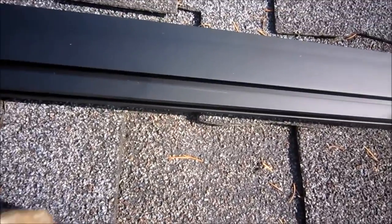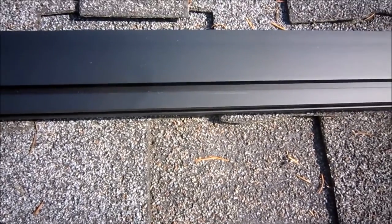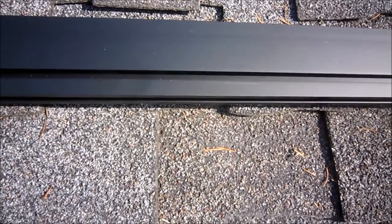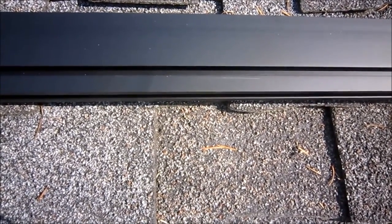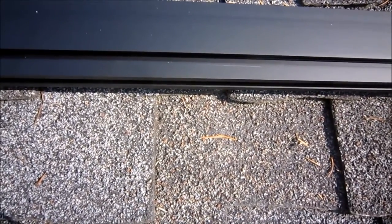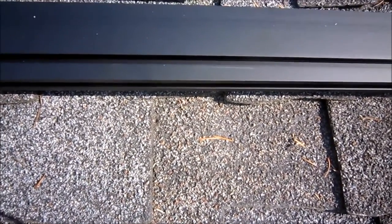You can see I made a little bit of a divot right here in the composite roofing — that's what I do with the end of my drill just to make sure once I've found my spot. Even if you change your mind after, you're covering it with a really big piece of flashing. So you can actually miss the truss and put another hole one inch to one side or the other until you get it, and it gets covered up by flashing. You do have to put some caulking in any extra holes you've drilled in your roof. Clearly don't turn it into Swiss cheese, but you should be able to manage that reasonably well.